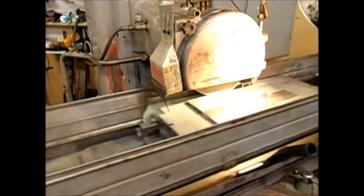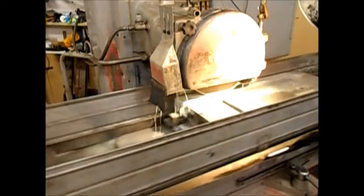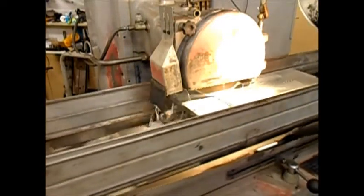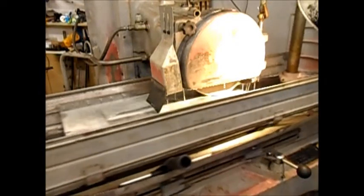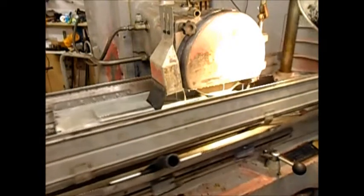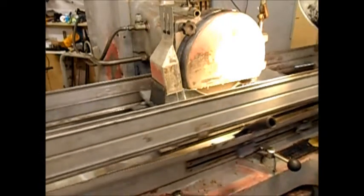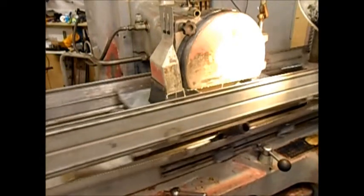I haven't used this in a few days, and it tends to get a bit of air in the system, so it's a bit jerky to start with. It's only the rough grinding to start with, so it's not such a problem. I'll up that cross feed — we're hitting there. Put that cross feed back down again. Could be a little burr I've missed, or a little bit of inaccuracy in the milling. You can only ever consider milling to be maybe within half a thou on a good machine, certainly not as accurate as your grinder's going to be.